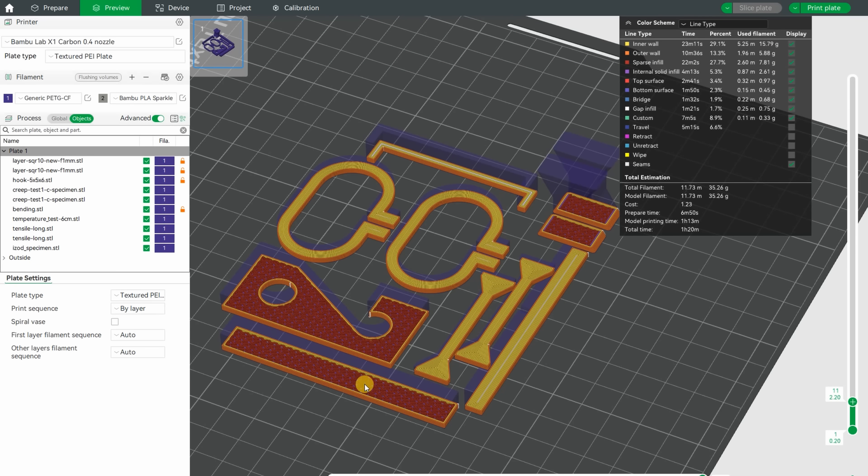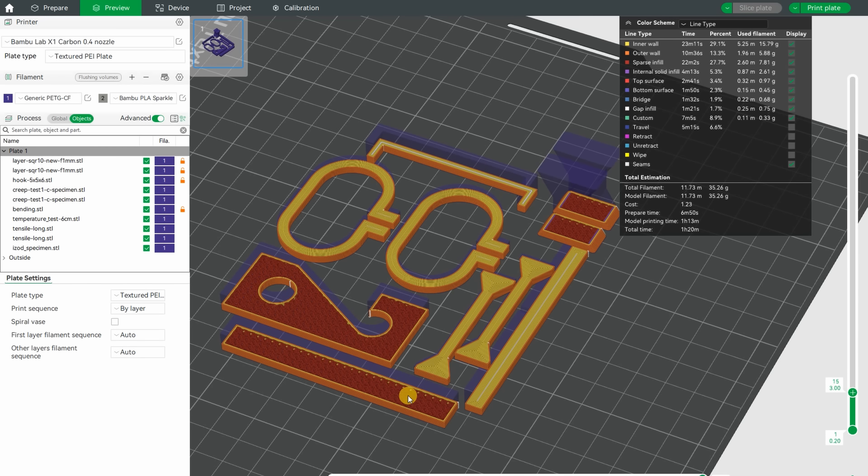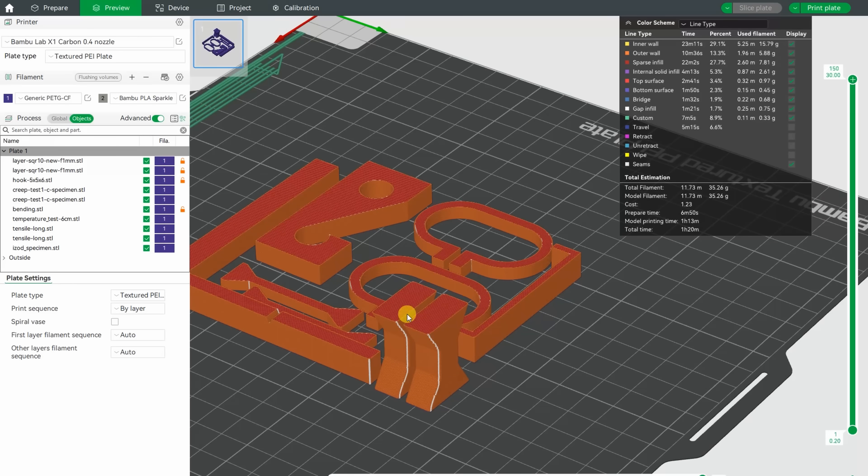These are my test objects. Some are solid inside, but some have two walls and 40% infill. A hook test object, one for the bending test — eight millimeters thick with infill inside. A thicker version for the impact test using the machine from eBay that can measure stronger materials. A longer tensile test object to try to measure some elongation — the smallest cross-section is 4×4 millimeters. Two objects for the creep test to compare bigger and smaller loads (1.25 kg standard). One for the temperature test with a bigger load than usual, and one for layer adhesion with two walls and 40% infill.